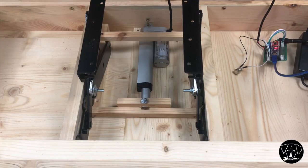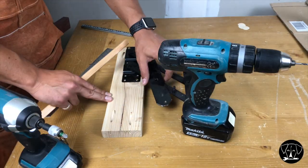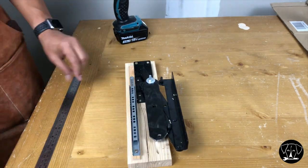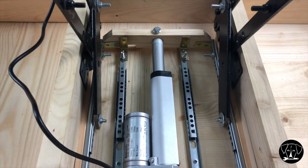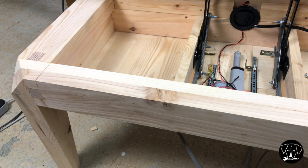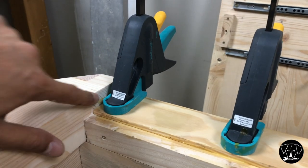This is the wooden structure that is pushed by the motor, and the problem is that it creates too much friction. So to fix this, I decided to throw it away and use drawer slides instead — they are very cheap, like you can get 10 for 10 bucks, and they slide very well. Some Loctite just to prevent the bolts from getting too loose. Here I am removing some material at the back and front of the table to give enough clearance for the table top to move forward and up at the same time, otherwise it will get stuck. The bevels I made earlier were not enough, so this also means I need to add strips of wood to the table top. It won't look as good as before but at least it will work perfectly.